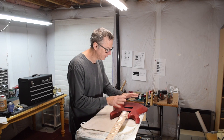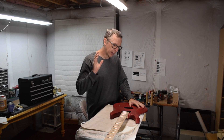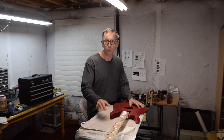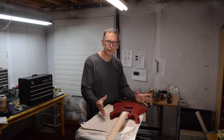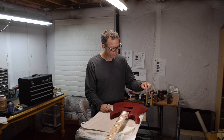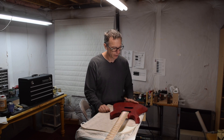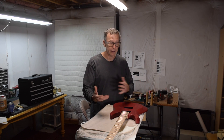When I created these files, my plan was to make the guitar body a fairly typical one and three-quarter inch thickness. I created those files, saved the G-code, and it was all ready to go, but several weeks went by before I actually went to carve this body. During that time, I decided I wanted to make the body one and five-eighths inches thick instead — shaving an eighth of an inch off, giving me a slightly lighter, more svelte guitar shape. Normally that wouldn't matter because the CNC bit is set at the XYZ home position and carves away the same amount regardless of overall thickness, so the bevel, pickup, and neck pockets are always the same depth.